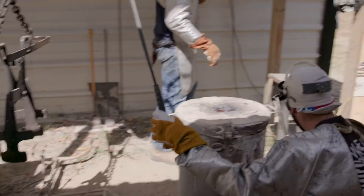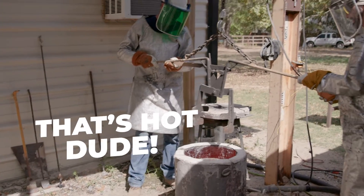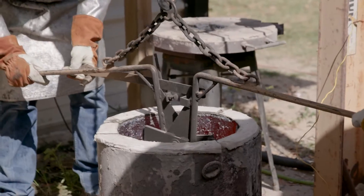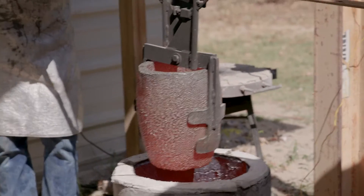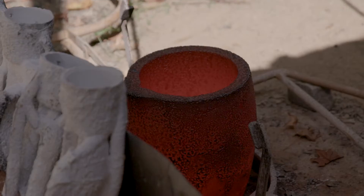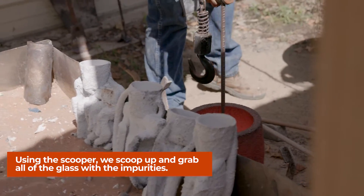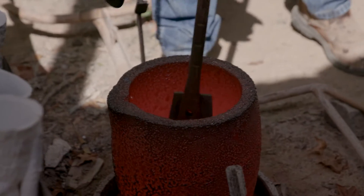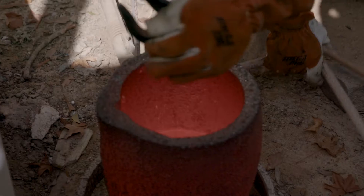We cut off the gas — that's hot! Lowering the crucible down, down, down. It's way more intimidating when it's actually glowing hot. We work the stirring stick to skim the glass off the top — watch how it almost acts like a mop, sticking right to it and pulling all that impurity off. It's a new crucible so it's radiating heat — I can feel it right through my jeans and boots, head to toe.